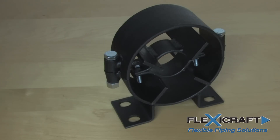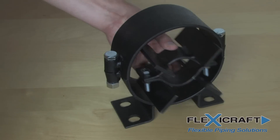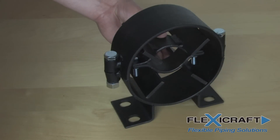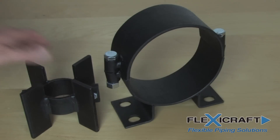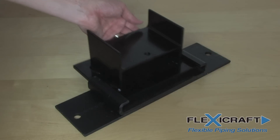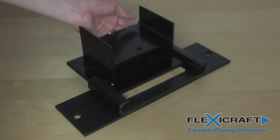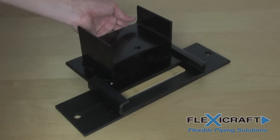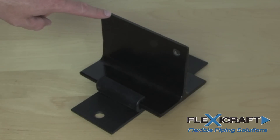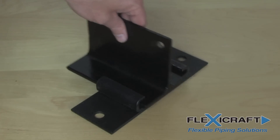The spider type guides are the most popular and include an X-shaped spider that attaches to and moves with the pipe. However, spider guides are not designed to take any load from the pipe beyond keeping it stable. In a horizontal pipe run it is possible to instead use slide guides that can take a downward load, most commonly weight. The fixed bottom plate is Teflon lined to allow sliding and has a rating for the load. The pipe is normally welded to the sliding portion in the field, but can also be made with clamps if preferred.